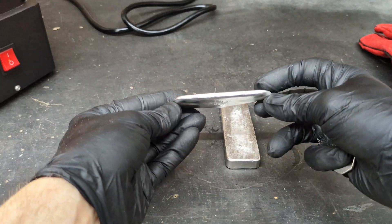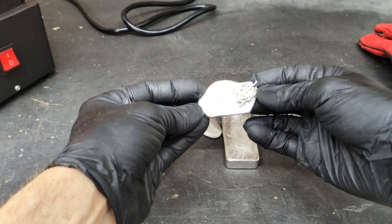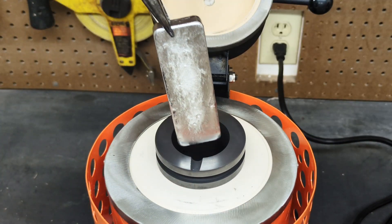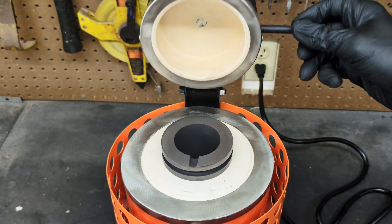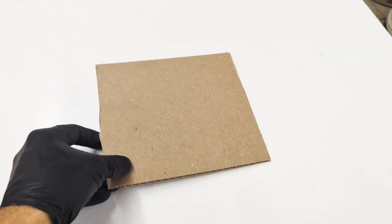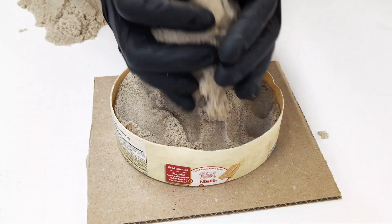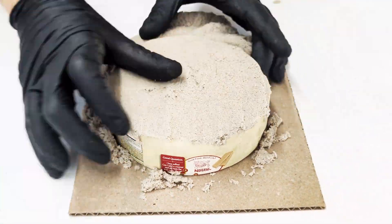I created these ingots by melting down some pewter that I found at a thrift store. With these ingots, I can now easily put them in the crucible to do some metal casting. It's always good to slowly put the piece of metal into the crucible instead of dropping it in. While that is heating up to 500 degrees Celsius, I'm going to make a sand mold using a piece of foam that I carved out with my CNC router — the 2-Auto logo. I'm using kinetic sand, which is great for open pour molds with a low melting temperature metal like pewter.